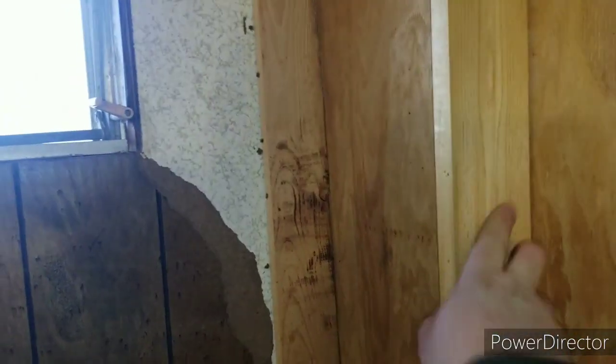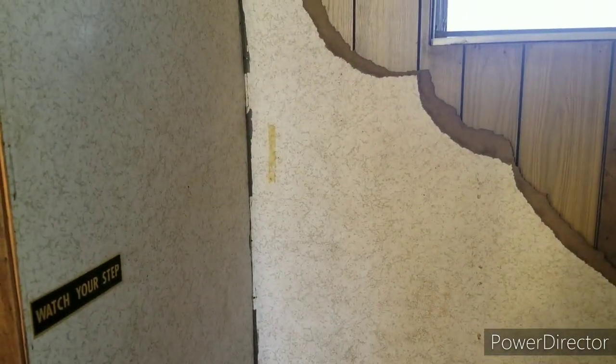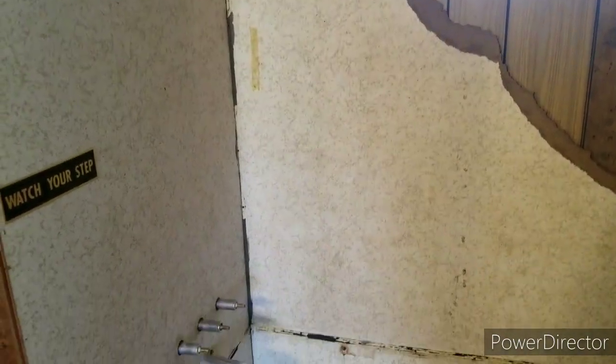She said she just had a hard time getting out of the tub. So I was like, well, your walls are 1x4 or 1x3 or 1x something like this. And it's not very good. And structurally, I think it sucks. So I told her what I'll probably do. I'll get some 2x4s, some stud grade 2x4s, maybe some treated ones, and rebuild this wall here and back here. That way it's nice and strong. See, y'all know how I like to build walls. That way, you know, I can put some handicap bars in her shower area. That way it's easier for her to get in and out. And it would just be all around mo better.